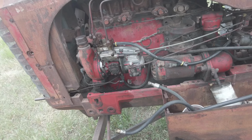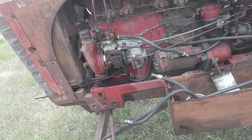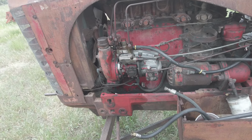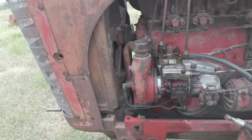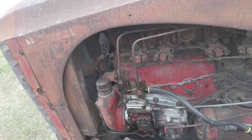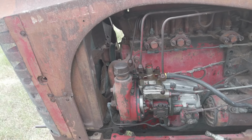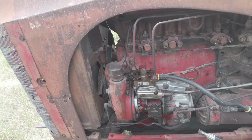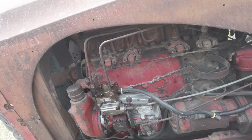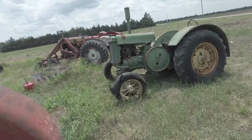There's the diesel guys that I've been talking with in Hutch. They have been super helpful. They said they probably could get me some of the parts. But I like to do a little shopping around before I do that. I think the next thing after I get the pump sealed is, maybe the smartest thing to do, like they were suggesting, pull the four injectors out, bring them in, make sure they're firing correctly, get them cleaned up, and then this thing, knock on wood, should run, which will bring us to the beginning of that project, which I'm excited for.